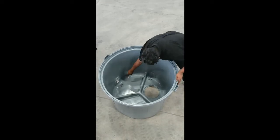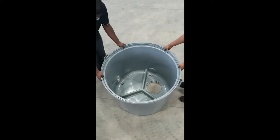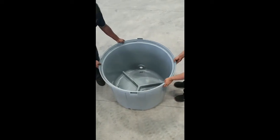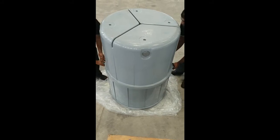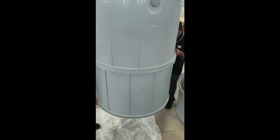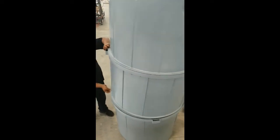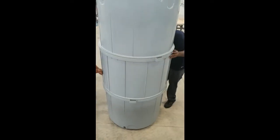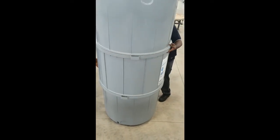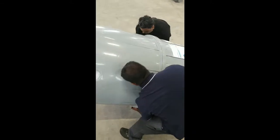Align where you want your overflow outlet to be placed once the tank is assembled, taking note that it will rotate 90 degrees when assembling the tank. Locate the alignment arrows on the base and center parts. Now assemble onto the top using the arrows to align the threads together. Now screw the center section down onto the top seal. Using the handles provided, carefully lay the tank down onto its side.